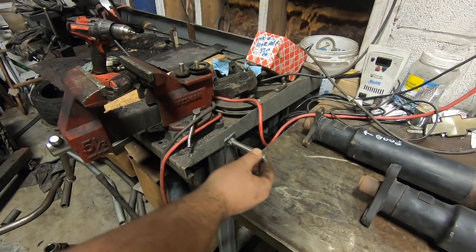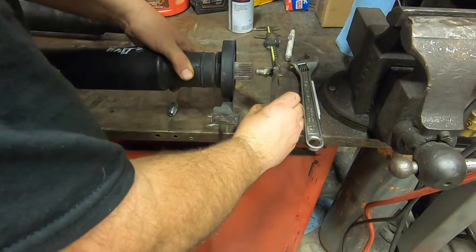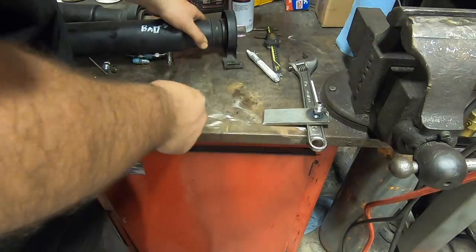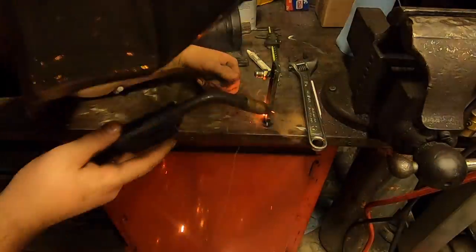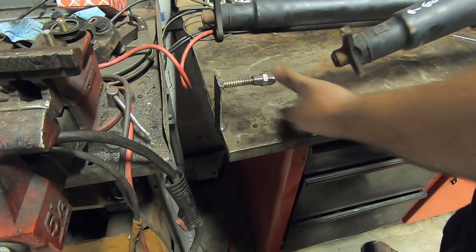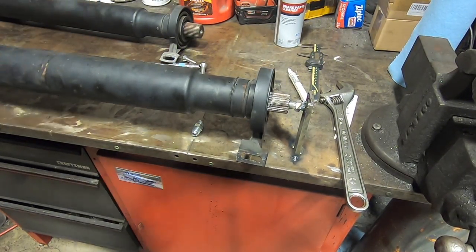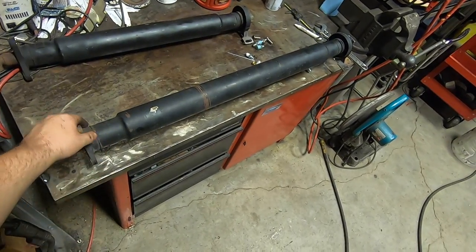That's going to be my spring-loaded center for that side of the shaft. Here's the concept: I've got a spring-loaded collar here to keep the tension on it. Take the driveshaft, push it on the centering cone, slip it in, and then on this side center it up, let the spring come forward, and there she is — we're centered up. Super simple little way to turn a shaft on centers.